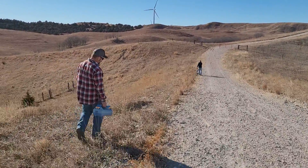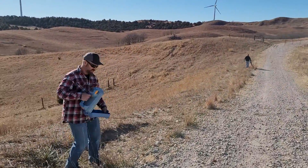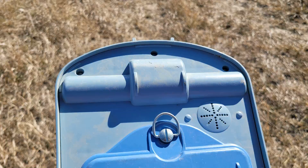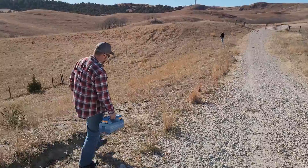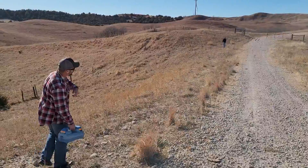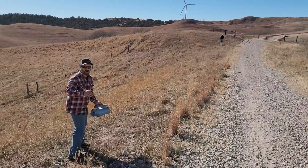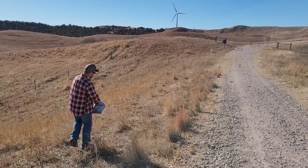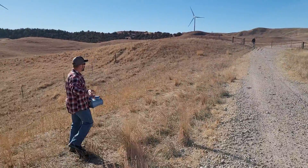I just hold the transmitter somewhat close to the ground — you don't have to bend way over. This has a really good induction coil, and you can see how big that induction coil is on there. As long as that's staying vertical to the actual cable, it's inducing that 33 kilohertz into the cable. I'm staying close enough to him to get a good signal all the way through. It seems like you have to have two people to do this, but you get a much better signal than if you're hooking up at the source because you're keeping the current higher all the time. Plus you're applying the current further away from the transformer and all the noise.